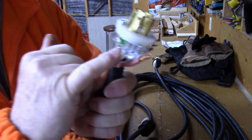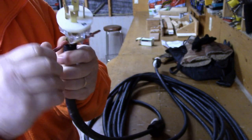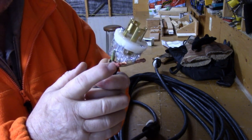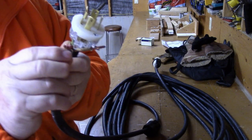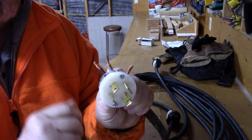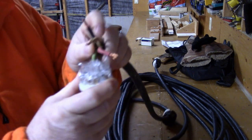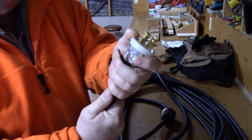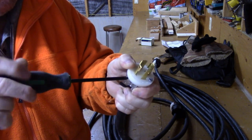If you look through the glass barrel there, you shouldn't see any of the copper wire. Also, when you put the wire into the connector, the wire shouldn't go in so far that the connector squeezes down on the sheathing of the conductor. The instructions say to trim back about a half an inch. So that's the ground wire on the ground conductor. Right opposite that is the neutral wire, and the neutral wire is white - you should always remember that. I'm going to direct that right up in the hole and it'll go right into that screw terminal, then tighten that up with the green Robertson.